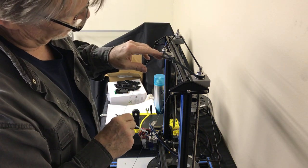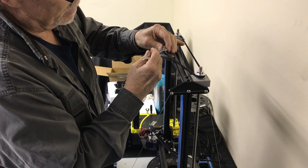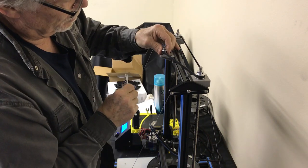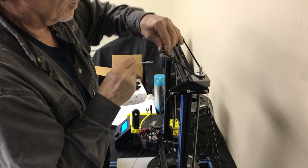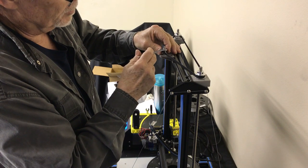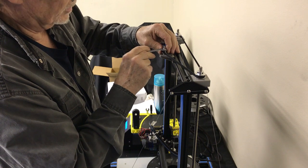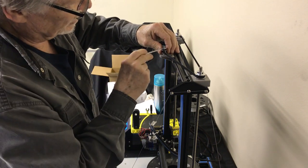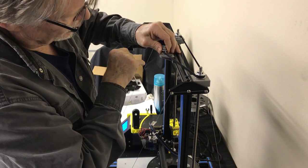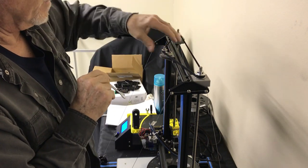Now what happens is that once I drew tension up on that, we're making more space underneath that washer, so you can see there's going to be a little play here. We're going to go till we barely feel play. If we go too far, because we can't feel that crunchiness in here now, we're going to probably push down on that bearing, and that actually will ruin the bearing. When I demonstrated that little crunchiness, that's really not good for the bearing. So I'm going to leave just a little bit of play in there. That's not going to hurt. I can see the little crack of light in there. Yeah, it's good enough. Okay, we got perfect tension on our belts.